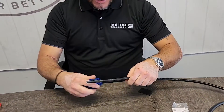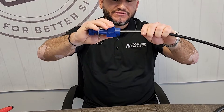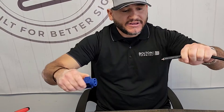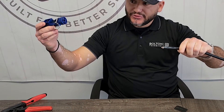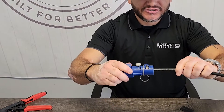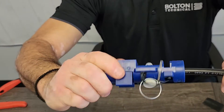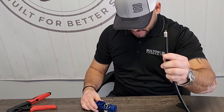If you're at home doing a self-install kit, you take your prep tool and apply it like so — clamp down, and when you feel that pinch with the cable you're going to turn 360. Do three or four rotations to make sure you get a good solid cut, then apply a little pressure on the knob and pull back. When I pull back you will see a correct prep for the LMR 400. Next, take the back side of the prep tool, insert and push through — this will cut the jacket at the correct length. Turn 360 all the way around, the jacket slowly peels off for the correct termination length, and when it's completely done it will spit out the jacket. Release and you have the correct prep for the LMR 400.